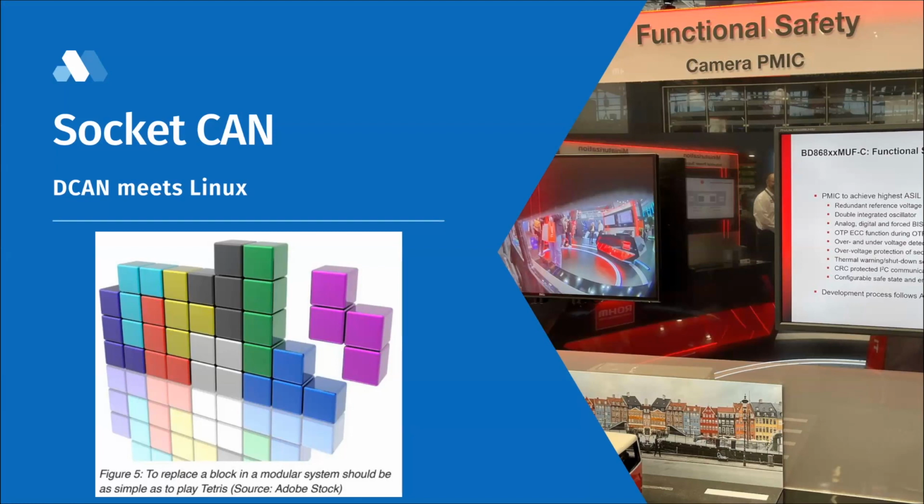It uses the Berkeley Socket API, so the use of a device is as easy as opening a network socket and writing or reading from it. The abstraction level is maintained, and the device driver benefits from the existing queuing functionality. The Socket CAN API is very similar to a typical TCP/IP layer model.